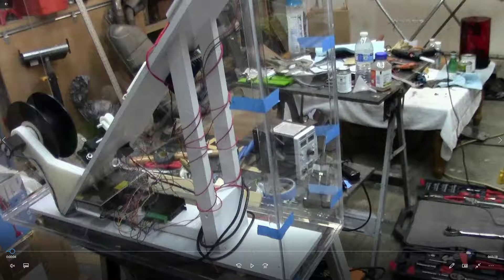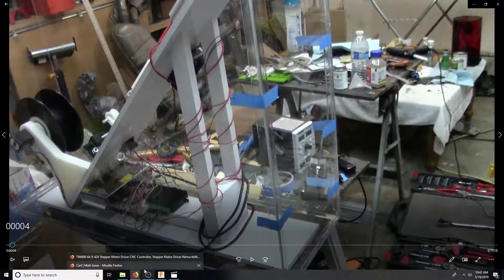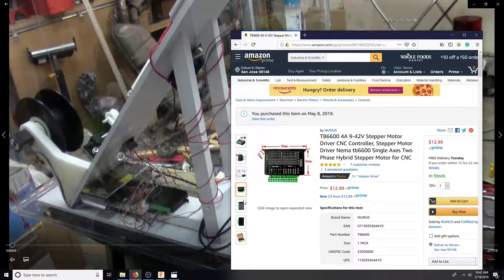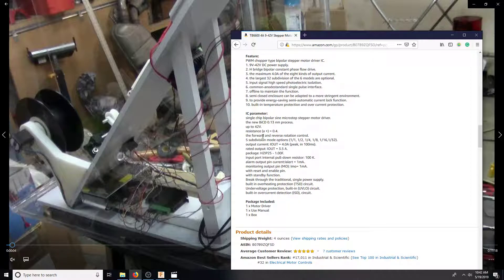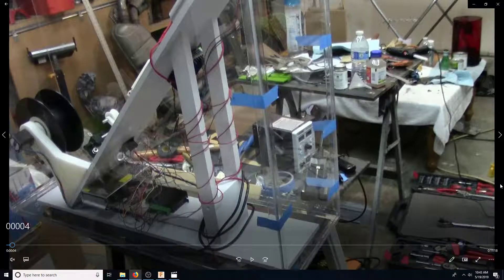This video is running long — we're at 33 minutes. These stepper drivers say four amps; we were pulling five amps so they don't quite have the amperage, but it says somewhere that the maximum dissipation is 100 watts. We're way under that, but it was starting to get hot. Obviously we don't have any fans going over these — the heat sink is facing up but there's no fan blowing over them.